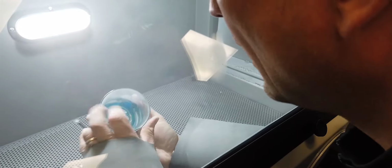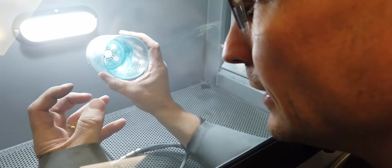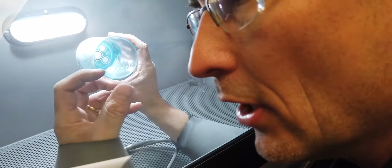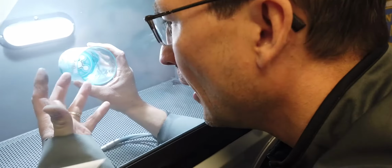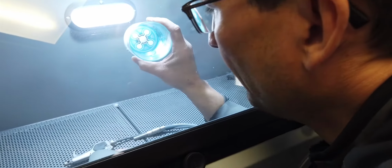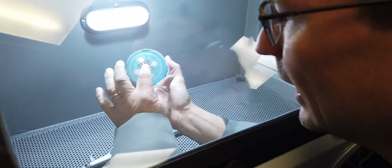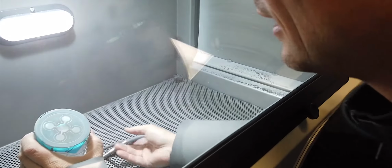Very important you have silicon carbide abrasive so you can really see the abrasive hit that glass and spark it, so you know where your abrasive flow is at all times. If you don't know where your abrasive is, it's really hard to direct and shape your carve on glass like this. So there's a little bit more of a dome effect now. It's more round now. It's not a sharp point now. So you can do that on all four sides.